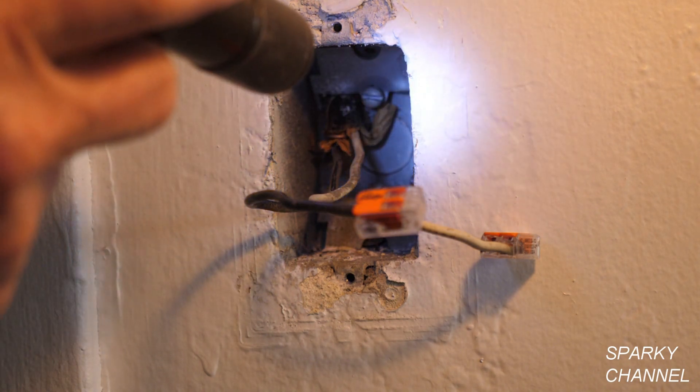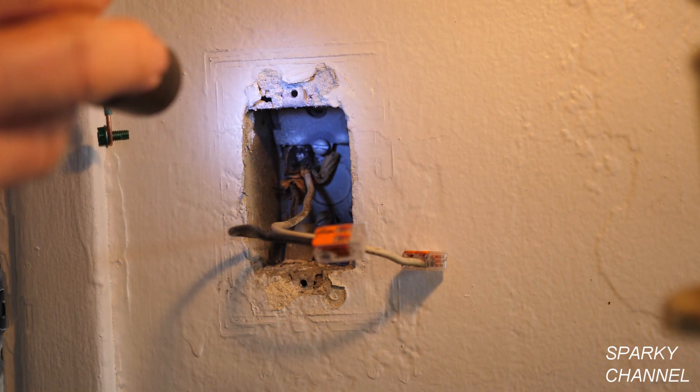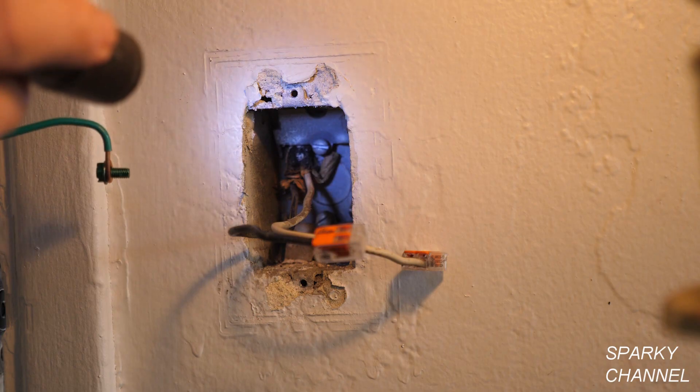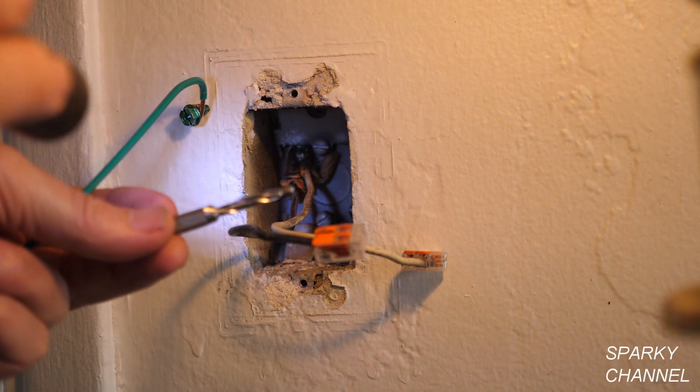What's happening in this 1960 metal box is that they ran a ground wire to the back of the box and attached it to the back of the box in the wall. Here's a picture I took of a different box in the same house. Not all the boxes in this house are bonded and grounded like this — this one in the photograph happens to be in the laundry area. The one I'm working on now has ground wires because it is on an exterior wall. A lot of the interior receptacles and switch boxes had no grounding or bonding whatsoever. So this box is grounded.